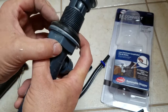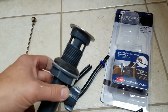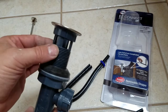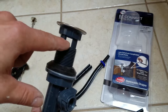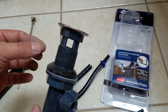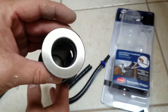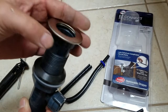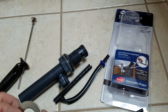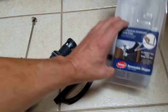The reason why there are so many threads and this is so adjustable is because it's for different sinks, depending on the thickness of your sink. These holes here are what let the water get into the drain pipe when you overfill the sink — those little holes in the sink run down a channel in the sink and go in here. This is the trim piece; it unscrews, so we take that off.